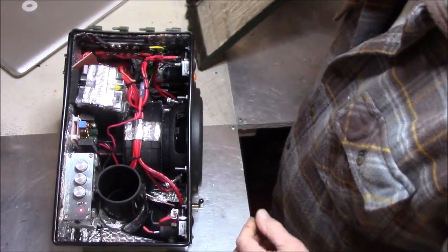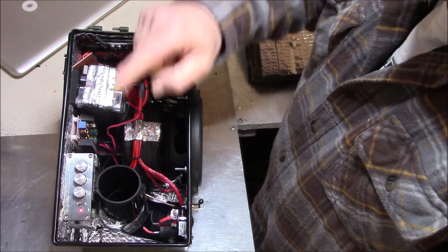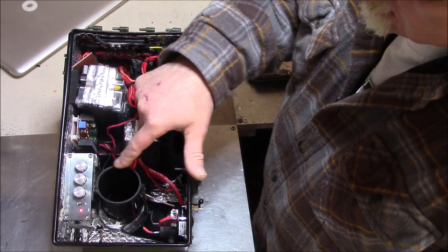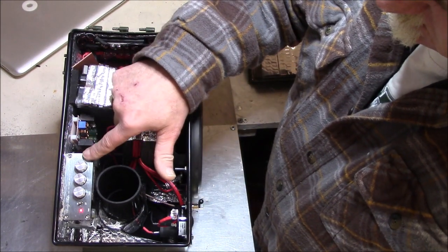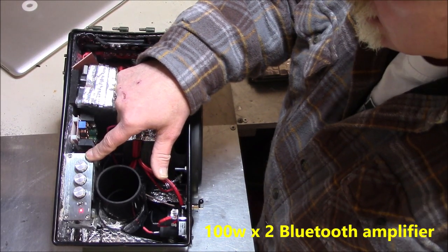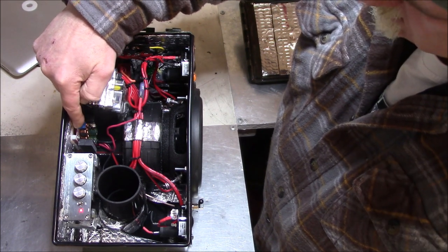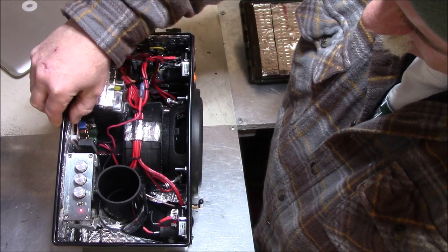Let's take a look at the good stuff on the inside. With this bass port tube, I had to adjust that. I got this cabinet tuned for about 42 Hertz and I used an online calculator to figure out volume and port length and everything else. Pointing at there is the 100-watt times two Bluetooth power amplifier. I've got that set for 24 volts using this step-up booster, which is hard mounted to the back of the box with a striker plate.